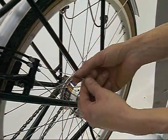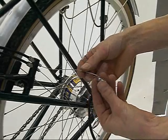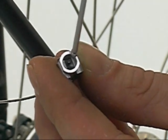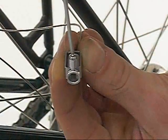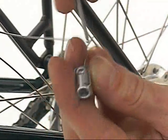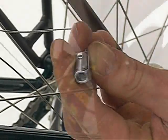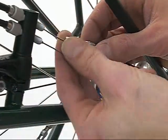Fully extend the 14th gear cable so you can fit the bayonet connector. Tighten up one of the headless screws until it is flush with the outside of the connector. Now tighten up the other headless screw. Tighten to 1.5Nm. Connect the gear 14 bayonet connectors together.